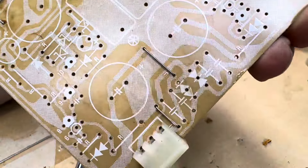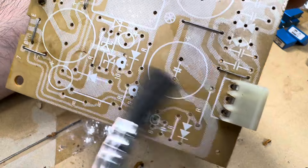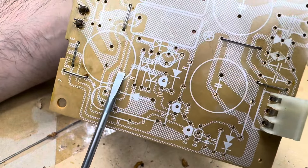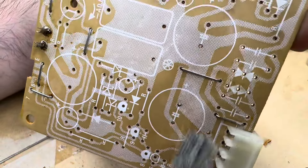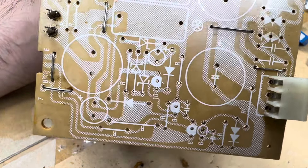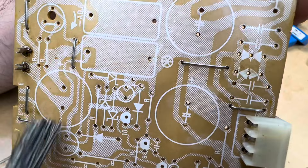This is not finished — I still need to hit it with alcohol. You can see there's still some residue, but basically the silkscreen is intact and the glue is gone. If you have any leftovers you can touch them up again. This isn't strictly necessary — as soon as you remove the majority of the glue and you're not touching any components, that's the end of the exercise. Everything else is cosmetic and has nothing to do with performance or the risk of corrosive substances causing problems later.